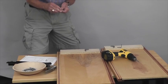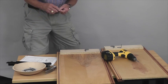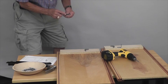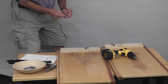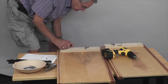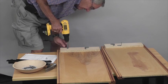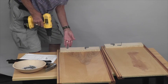I'm going to attach the L brackets with five-eighths number seven screws — those should be loose in the packet. Some of the other five-eighths screws are for special purposes and are in little packets that tell you what they're used for. The L bracket has a hole or a slot on one side and just a slot on the other. We're going to use the side with just the slot, securing it to the glide support bridge we just put in, flush at the top.